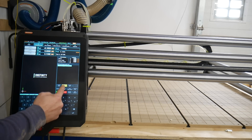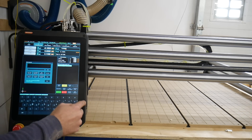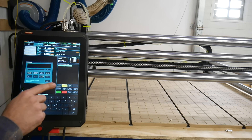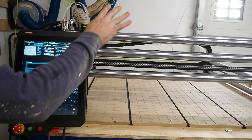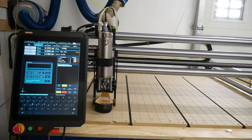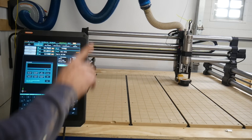In here this is where you control your spindle and your vacuum — you can turn all that on in here. We'll go to MDI. So you can set up a parking position — after you cut your job you can push park and it'll go wherever you want to set it. I set mine to the back right corner, so after a carve I can just click that button and it'll go up and over.